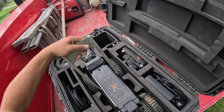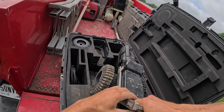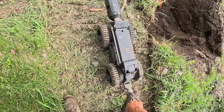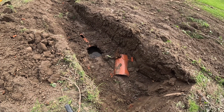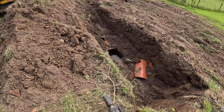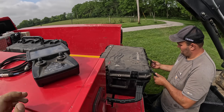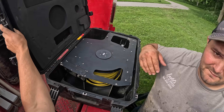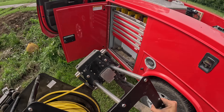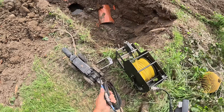Oh, she's a beaut! Goodness, it's heavy too. Introducing our little pipe tracker here — we got a camera going up this 24 inch main so we can figure out what's running off the pasture, maybe even a house or whatnot, because we're getting ready to replace it. It's basically like a big RC car with a camera on it. And here's our cable that connects to it so we can see everything. It's a pretty cool contraption, if I do say so myself.